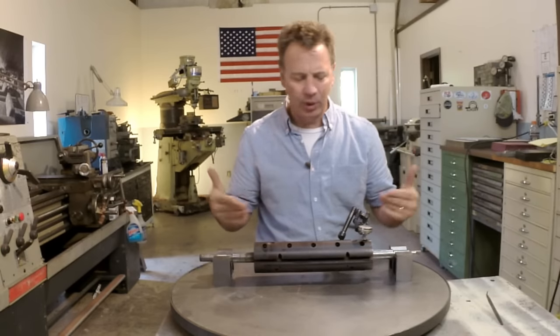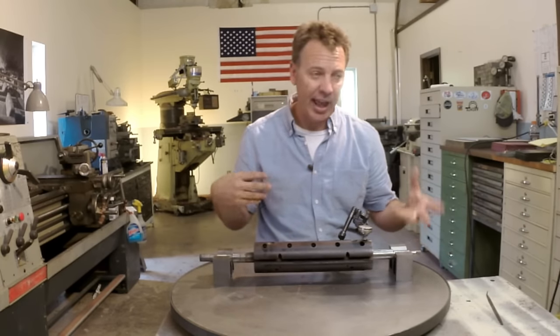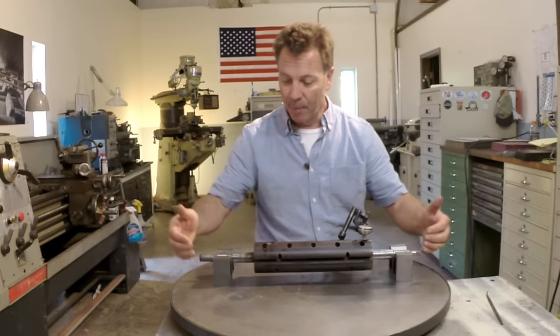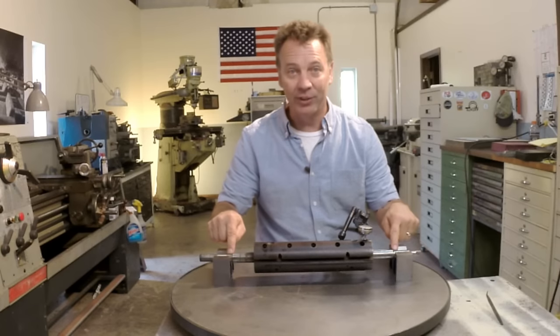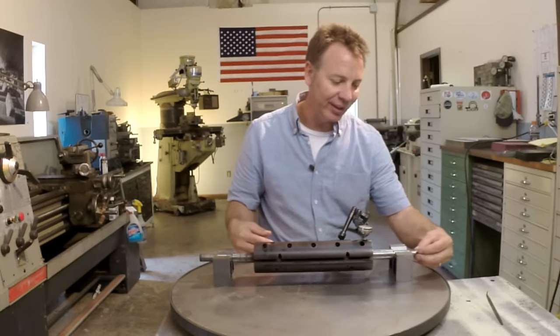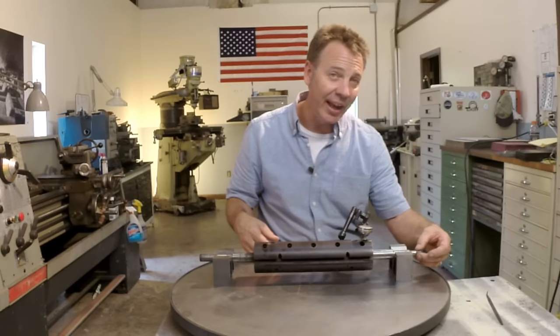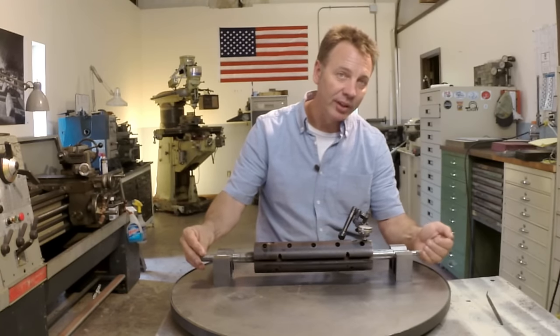One of the ways you would look at this project is we have center holes in the shaft. I thought I'd just chuck it on there, but when I did that I found out it was about 5 thousandths off from the bearing surface. So there's something a little out of whack. When you look at this end shaft — that's probably about 3/8ths, maybe a little bit more in diameter — it's probably bent, and that's what put this off center.